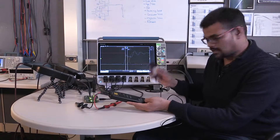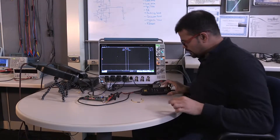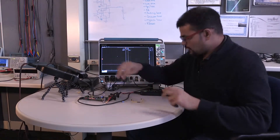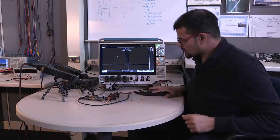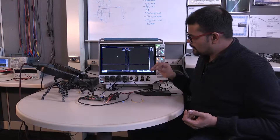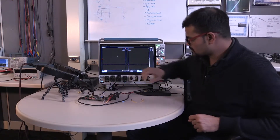Give me a second, I'll plug this in, we'll just skew it and then we'll get rolling. I got this probe connected to our VGS connections on the square pin side. The pins are too big so I couldn't fit them directly on the pins, but that's okay. I wound the cables and all that stuff — this is something we use all the time to make high frequency measurements. I just want to show you how the measurements actually change quite a bit when you have setups like this with long leads, ground loops and so on.